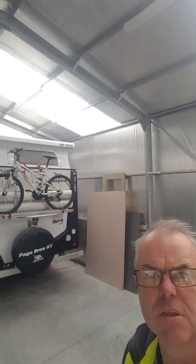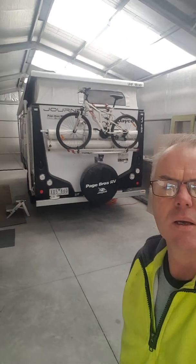I'm going to build a wall behind the caravan there that's going to line up with the column and rafter that you can see, and incorporate a couple of doors so I can walk through from the front of the van, and then insulate it, line it and close up the area so then I can start lining the walls around here. I ordered some ply that's going to allow me to mount things on the wall as I go. And then once I've got that, I'll move on to the kitchenette there. So, on with the next project.